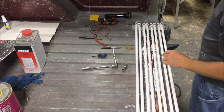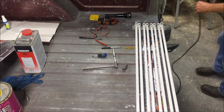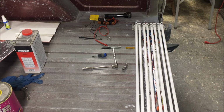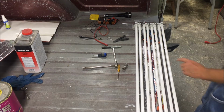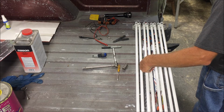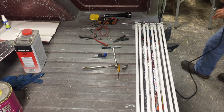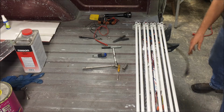Okay, got all the bulbs back in. Only one ballast is actually wired up, and the test still got a problem. We're going to check and see if the other one will go. Now we're powering the ballast that had the black spot on it, and we've disabled the one that's closest to me. I got the GFI reset over there, and let's try this.